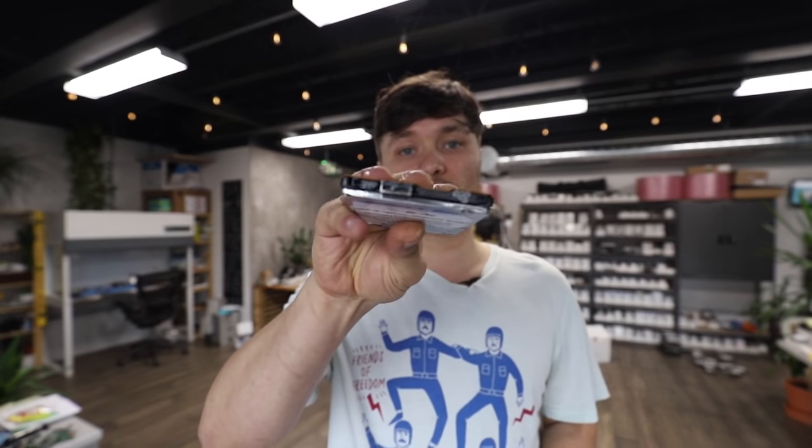The purpose of doing that is, on Western Digital Passports, as a lot of you may know, there is no such thing as a SATA connector. There is a USB 3.0 or USB 2.0 interface that was already automatically integrated into the circuit board. There are several ways that you can try to resolve issues with it using the USB port, but I find that it's extremely uncomfortable. The technique that I use is a conversion technique. So from USB interface, it's gonna go into SATA interface,